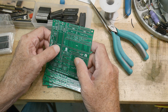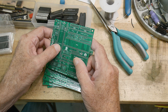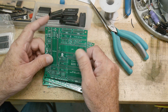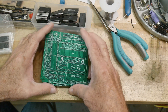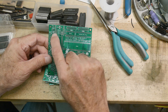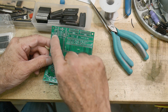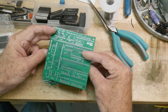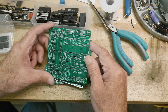It's a PIC18F47Q10 — I'm not familiar with that part, but it handles kind of all of the glue logic and everything. They lie a little bit though, because you ask where's the ROM? The ROM comes off of an SD card, which is a little module you buy off of eBay that plugs in here. There's also a real time clock you can add. It's all well documented — it was a Hackaday project.